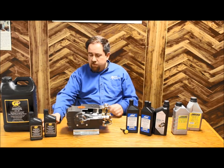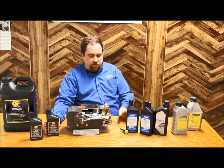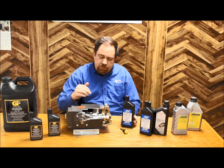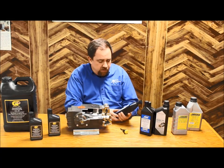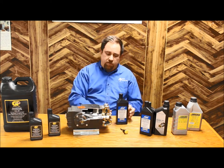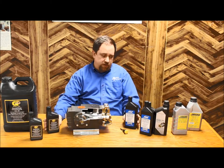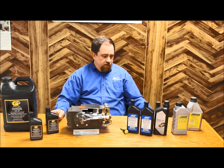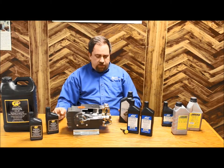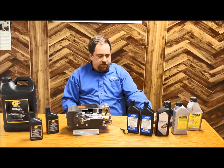There are brands of oil to consider. General pump oil is great in a lot of the Italian pumps, very similar to what's used in AR and some others. CAT has an ISO 68 oil, which is a little thinner. Their lubricating surfaces are a little lighter and flow better in keeping the cross-head areas lubricated properly with the CAT oil. If you put General pump oil in a CAT pump, you might not like the results or it could void the warranty. We also stock Landa's pump oil — premium 10W-40 — with the additives in it, and it works across a lot of the different Italian pumps, including the Landa pumps.